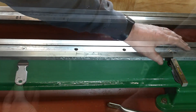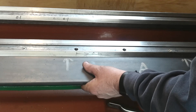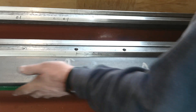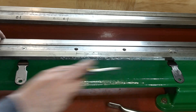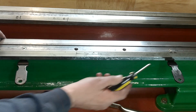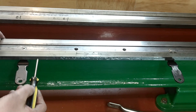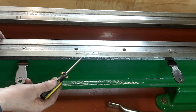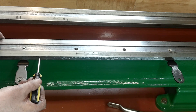Using a small engineer's spirit level over the two closest V-slides, I then matched the three brackets by bending them to suit. Using these supports like this will leave the lower edge of this entire face unconfirmed, and from what I can see this face does nothing more than get oily. But all I want is a linear track along its entire length to confirm any of my measurements.